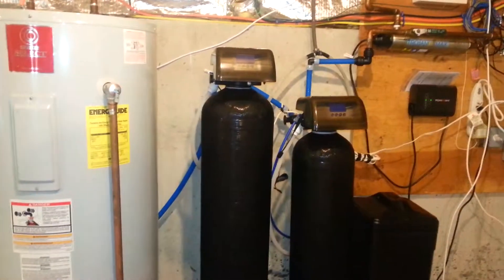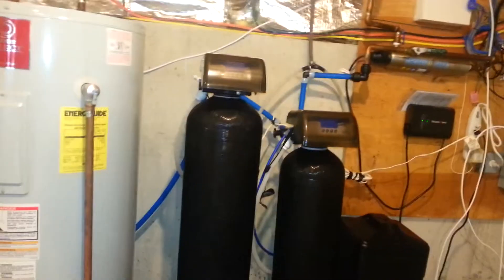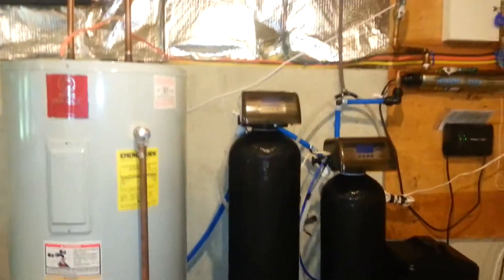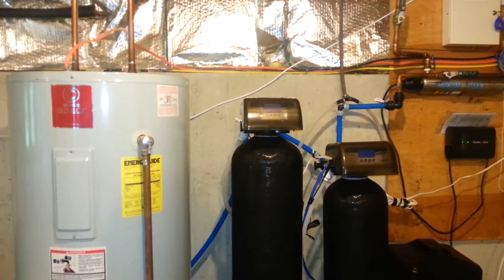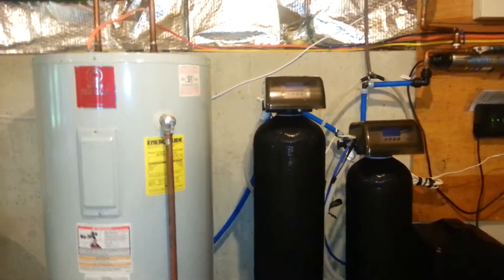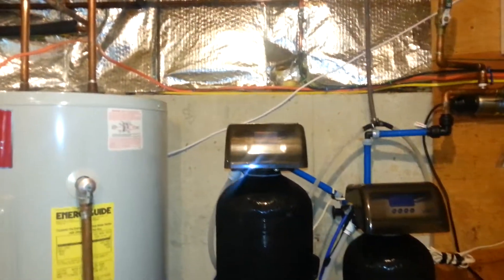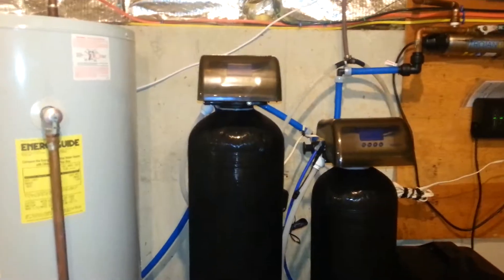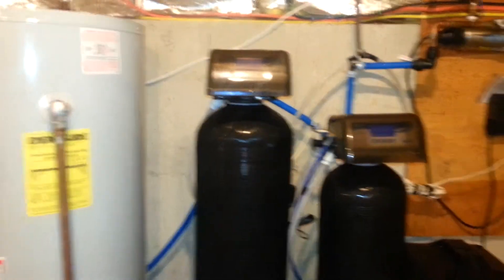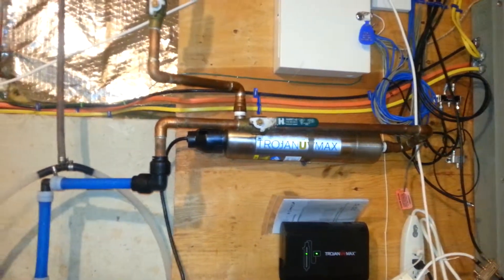You really need to size the system to what the pump is capable of providing, not just some magic number from a bathtub bucket test. You need to know what size pump you have and how quickly it makes water flow into the house, otherwise you won't get the backwash flow rate necessary and the system will clog up — giving you a worse iron problem than if you had no water treatment at all. Basically what we have here is a 10-by-54-inch Catalox filter, our 32,000-grain water softener, followed by the already-existing UV light system, which is functioning fine. Thank you for watching.